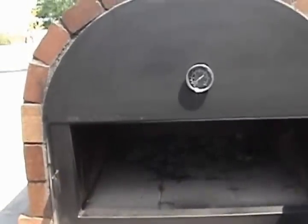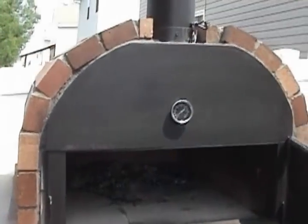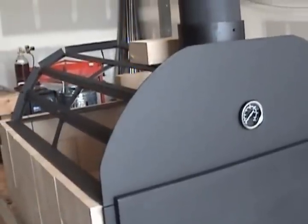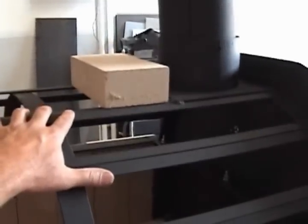I'm going to take you to my shop and show you the steel reinforced structure of the dome and arch for the brick oven. Here you can see the basic steel structure — the steel with the brick. When everything is mortared in place, the combination of steel, brick, and mortar makes it much stronger than brick and mortar alone. The frame of the arch and the dome is also bolted to the door frame.